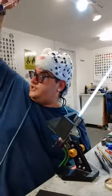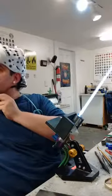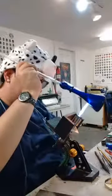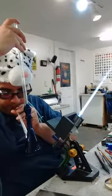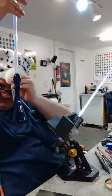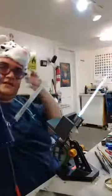With these cobalt tubes, it's important to check. You gotta look right through them in the light and make sure that there's no wrinkles or anything that'll make that joint a lot weaker. So I see one wrinkle in here. Okay, there we go. I think that's about as good as that one's gonna get.